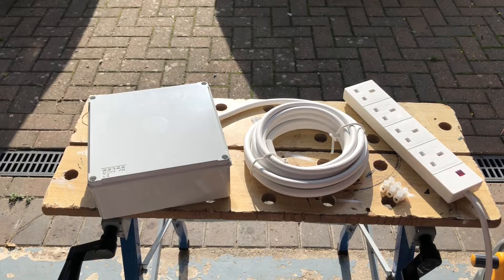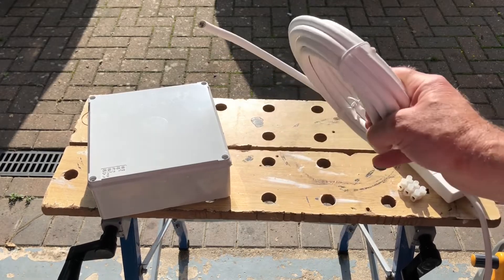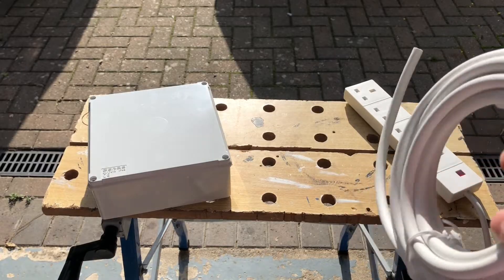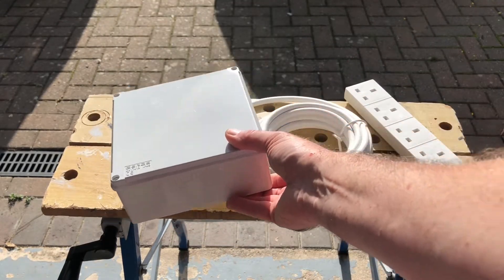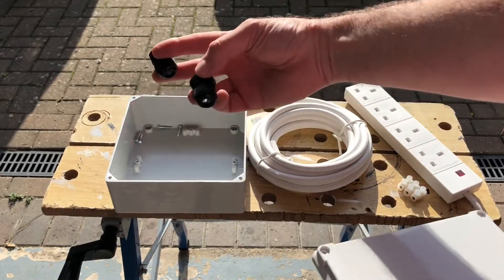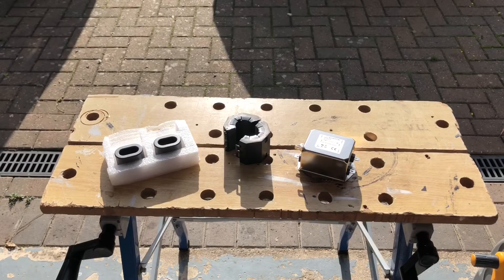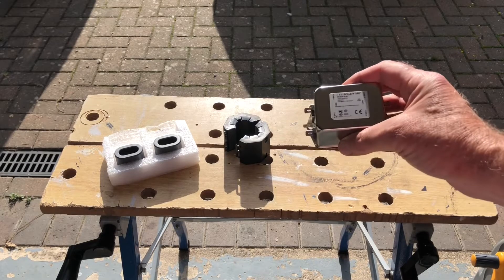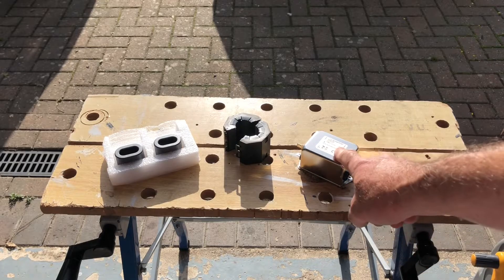In terms of parts, these are the passive parts of the project: an extension lead, a piece of connector block — I think that's 16 amp — some 2.5mm three-core mains cable. In theory you need about two metres but that's a five metre roll, about £12. An IP65-rated box large enough — I'll put the size in the description — about £9. Two glands for connections, about £1 each. This is a commercial mains filter — a Schaffner. Ian's website also has a description of a Roxburgh filter, both a similar spec. That was about £15.